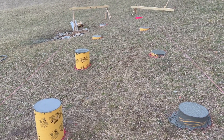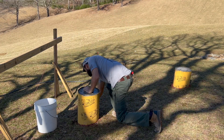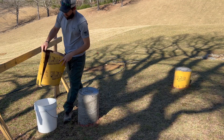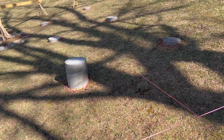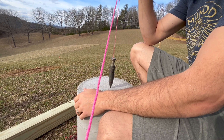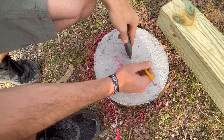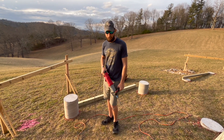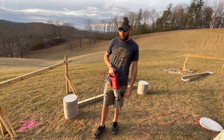Our concrete has set and I'm removing the sonotubes. We're going to use our batter board layout for the final time — that's why it's so nice to have it set up this way. You can remove the string lines and pop them right back up to get exactly the layout you had previously. We'll plumb down one final time from our string lines onto our foundation. You can see how nicely it ended up being in the center of each foundation — the more work you put in at the beginning, you end up dead center.